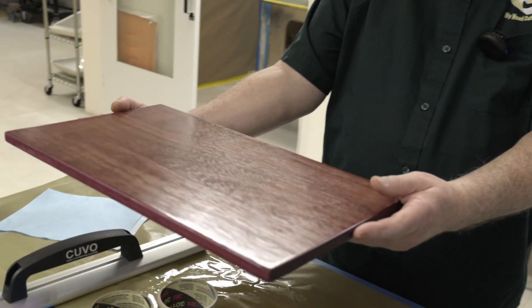At this point we're really happy with what we see — it's uniform, we've got the open grain effect. Let's turn the lights on. Let the lights run another few minutes before you come check. We keep talking about all the lights, but you can also just bring it out into the daylight. Indirect sunlight and even direct sunlight, even on a cloudy day, creates enough UVA in our atmosphere that will actually cure these materials readily. You might need to leave them out for 70 to 90 seconds or a few minutes, but indirect sunlight, cloudy days, direct sunlight will all readily cure this material.